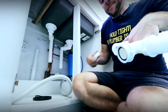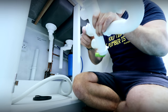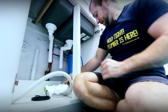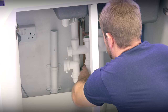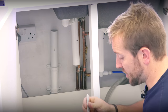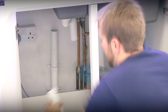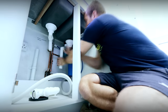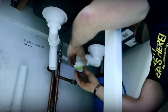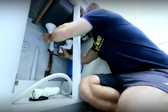Keep all the old spigots and everything like that in a box, because you never know you might be adding bits and pieces to your kitchen in the future. You don't want to be throwing this sort of stuff away. So you can nip these up nice and hand tight. Next up we're going to make some cuts - I'm just going to mark up where I want to do them. I know exactly where I can put these, so I can make a cut here and also a cut just here - exactly roughly the same level as each other. I've got some lovely cutters so I can cut these really easily. Then we can put our nut and our sealing ring on there, and then we're ready to do up all the work we've just done.